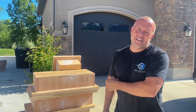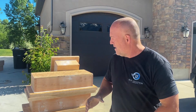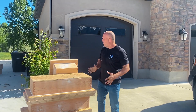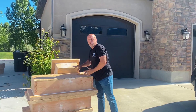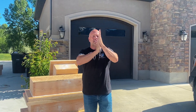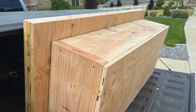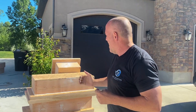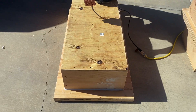All right guys, for the tail end of finishing up these window boxes — the shape has got this outer edge right here where the window pocket will be inside the concrete wall. This inner edge is what you'll be able to see through to get to the window, and this overlap is where the window meets the concrete and steps to the visual viewing point. That's why the box kind of has a step. You can get concrete window bucks that go in a form but they won't work for the type of window seal I need to make. I need no tapered edges so that I can get a really good seal on the window inside the pool.